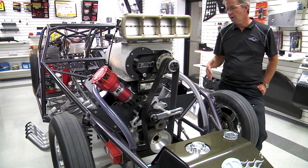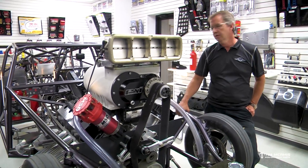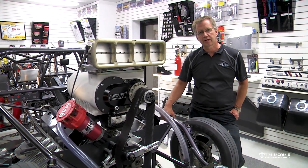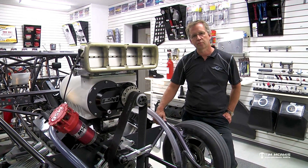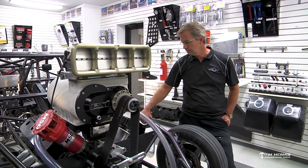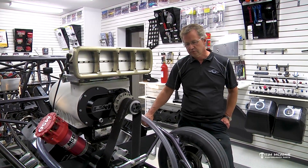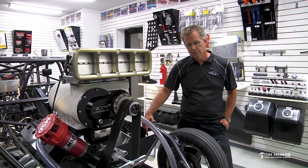What that means is the tube has a very consistent thickness throughout, so it has a much tighter tolerance than a mild steel tube would. That spec is required so that there's consistency in all these builds, so that when this thing gets teched and sonic checked, the inspector will know what size tube it is and what wall thickness it is. So again, everything we do is 4130 — it's kind of hard to justify why you would do something out of mild steel.